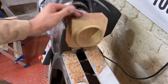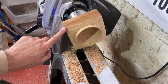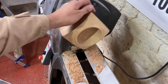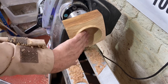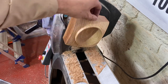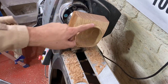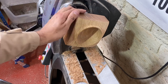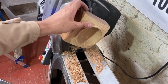So I've got my finished shape. The tricky bit is actually sanding up these edges because I value my fingers, so I won't be doing that with the lathe spinning. I will sand the inside of the bowl and the rim with the lathe spinning, being very careful on the rim, but I don't intend to go any further outward whilst the lathe is spinning. So I'm going to have to do it by hand, which is going to take some time. I'll come back when it's done.